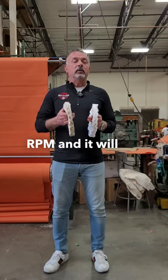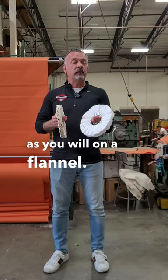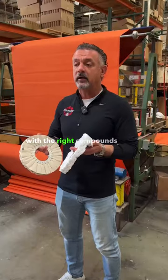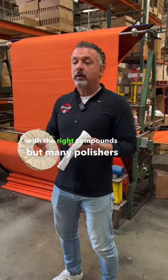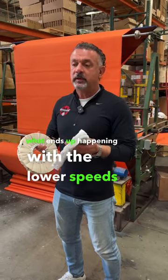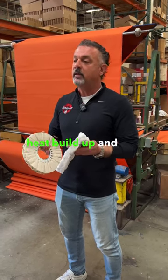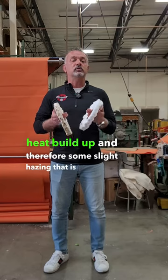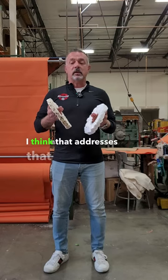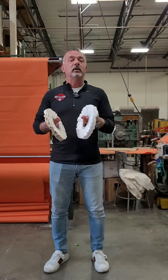What this allows, and why most polishers like this, is because you can run this at a lower RPM and it will not build up the same amount of heat as you will on a flannel. Flannel and the UBM will both give you fantastic high-lustre finishes with the right compounds, but many polishers notice that with lower speeds on flannel you do end up getting some heat buildup and therefore some slight hazing in the final finish. So if you want to try the UBM, it addresses that because it does not heat up anywhere near as much as the softer fibers of the flannel.